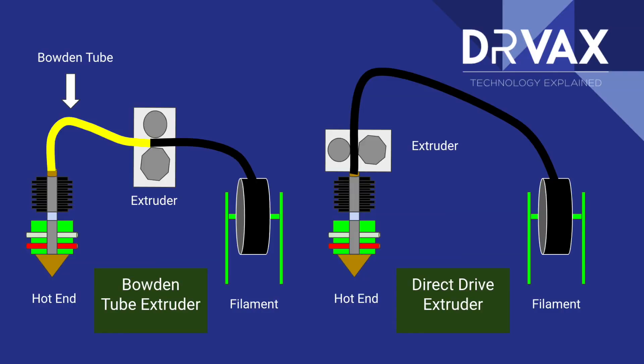The picture on the left shows a Bowden tube setup, which is the Ender 5's setup. In that case, the extruder is pushing the filament through a tube and then pulling it back through that tube, meaning there's a fair amount of play. Depending on how tight the tube is, there may be more or less play — which is why upgrading to Capricorn or a better quality Bowden tube makes a difference. It's a less rigid system with more variability. That means retraction distances — when you pull the filament back — have to be longer, and possibly slower, on a Bowden-based system to eliminate stringing.